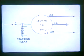The output of the alternator on the AC generator section of the inverter provides 115 volt AC three-phase 400 cycle current. The phases are lettered A, B, and C. In the DC-6, B phase is grounded to the aircraft structure. By utilizing connections from A to B, C to B, or A to C, we can obtain three-phase or single-phase AC power as desired. AC equipment in the aircraft uses both single and three-phase AC power.